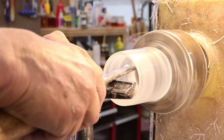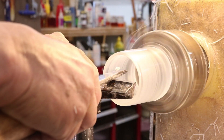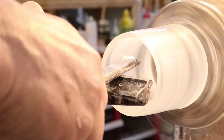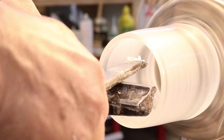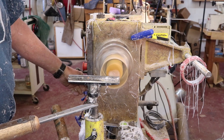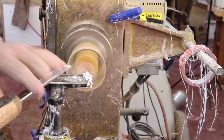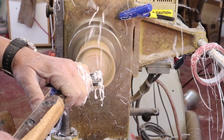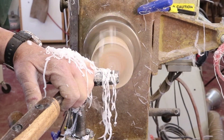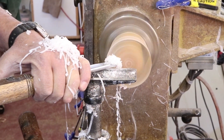Here's another view of the tool working on the inside of this cast resin piece. It really doesn't take off very much — how much it cuts depends on the burr, and I don't have much of a burr on here. I wanted to be careful and not get a catch since it's a little bit thin. Now this is the very end of another piece of cast resin and it's really out of balance — probably a quarter of an inch out of round on the very end. I'm taking some pretty aggressive cuts trying to level that surface off, and that's the beauty of a negative rake scraper — you can use a little bit more force.